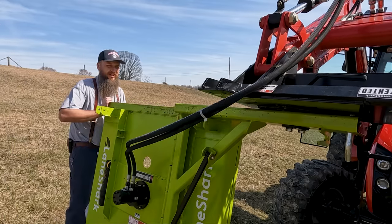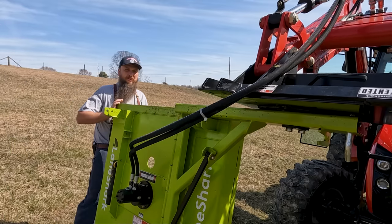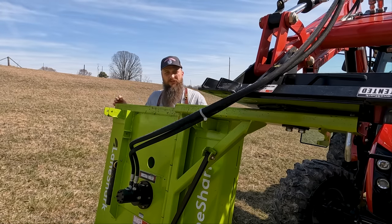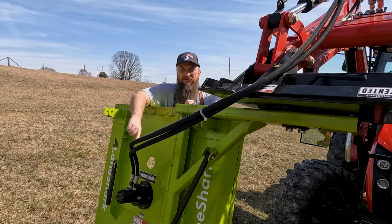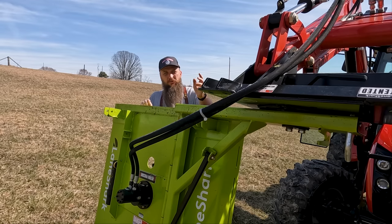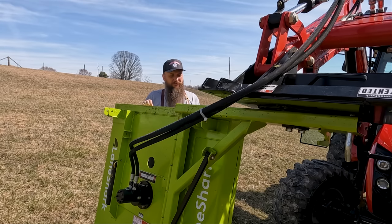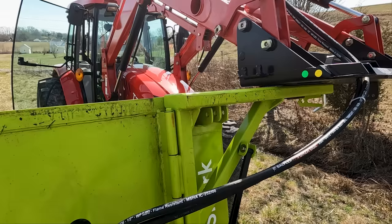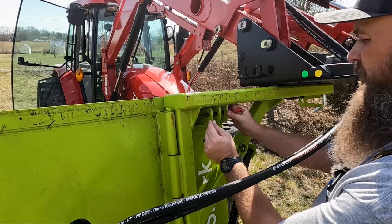My battery went dead, guys, so you missed out on some of this. But it's pretty simple to get in this position. It ain't too bad. You just gotta do it once or twice, and it makes it easier every time. And something I will do the next time, I'll take these hoses off, because half the time I was trying to position this, I was getting the hoses out of the way so I wouldn't kink them or pull on them any. So if you do buy this lane shark, take the hoses off. I'll do it from now on. Make this a lot easier. This is the position we want, guys, to do the fence row. Put in this pin. We'll be ready to get to work.